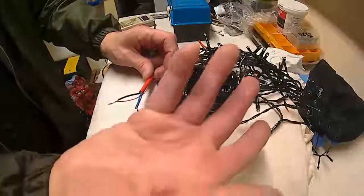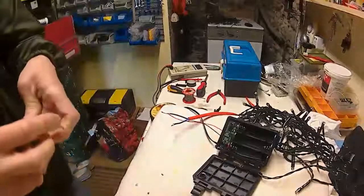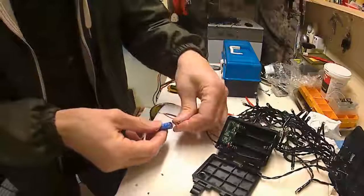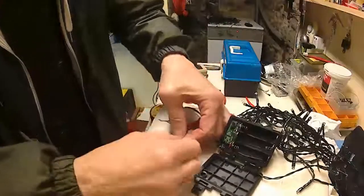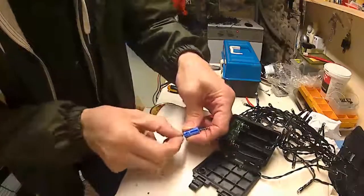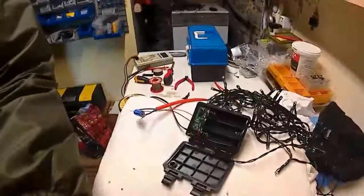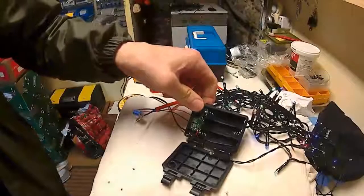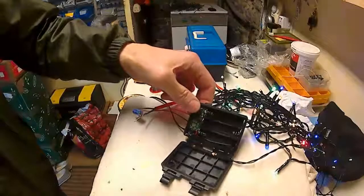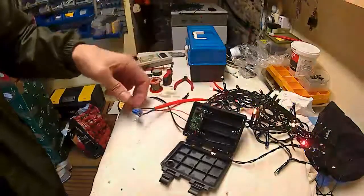It doesn't work, but there's a solution to this problem. What I did was add a capacitor — just an old capacitor I found on a radio. It's 470 microfarads. It's not critical; I didn't do any measurements or calculations for this. But putting a capacitor across there should make it work. You have to make sure the capacitor is the correct polarity. And it's working! That was about 30 meters there.